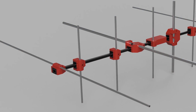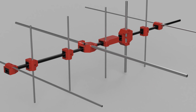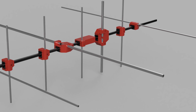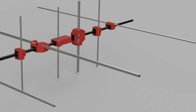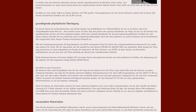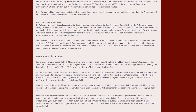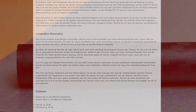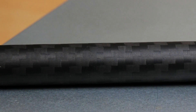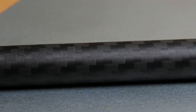Using this information, I designed a Yagi in Fusion 360 with a carbon boom and 3D-printed mounts for the elements. You can also use it with a simple aluminum boom from DL3RTL, which has a bit more weight and complexity. To build the antenna you need two 52 cm carbon tubes with a 12 mm diameter.